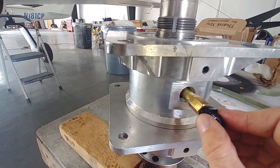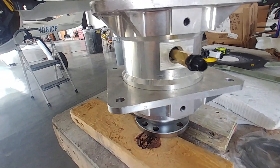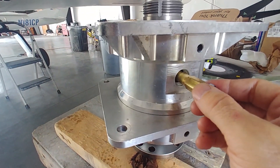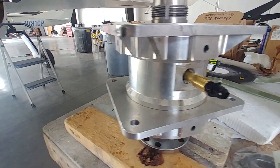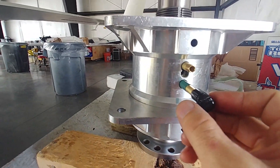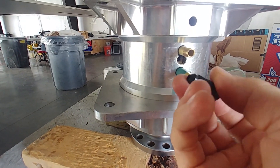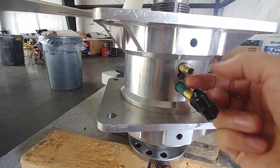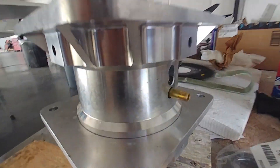This feed hole needs to have its thread cleared out a bit more. I wanted to test everything and confirm there was some sideways movement in the collar — that's what I was looking for. On the holes for the return lines I needed to clear those out a little more on the top and bottom so it wasn't resting hard up against the outside casing. The holes I drilled by hand lined up fairly nicely — they just needed to be a little bit larger.